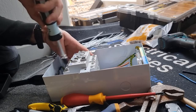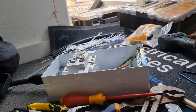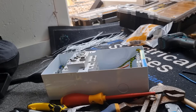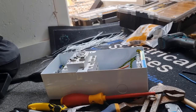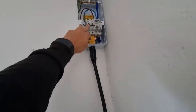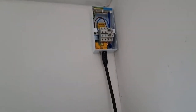These are just nipped up for now - I'm going to go get the torque screwdriver, torque them up, and then we can mount the board up where we need to go. This side's done - torque them up. So it's mounted, we've just got to cleat this down, push the slack back through, and that's it - this one's done. The customer just wants this done for now, then they're going to get us back to wire up the lights and sockets, but we'll get this tested and turned on.